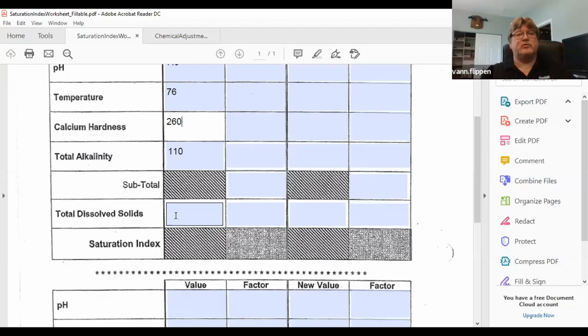And as I add chemicals to that new water, and calcium, and bathers, everything contributes. So what's going to happen is your TDS is going to start to rise. And then it hits a plateau, and when you're backwashing or wasting water, it dips down and just keeps going up. But it rises to one level. So if you want to know what your TDS is, take a bottle of your city water to Pinch a Penny, Leslie's Pool, somebody who does some of these free water tests, and ask them what the TDS is of your city water, and then take a sample of your pool water. And the difference between those two numbers is the difference that you're looking for.